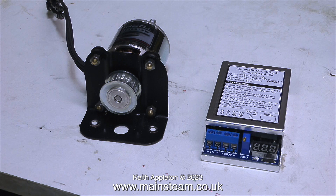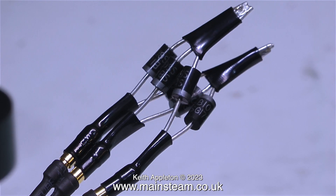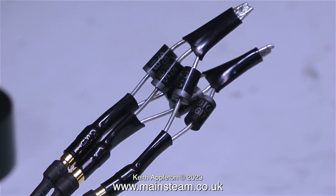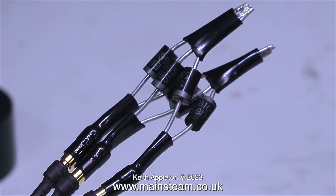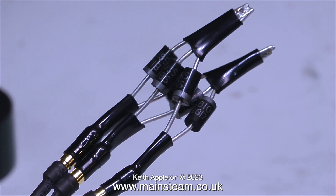The generator is on the left — although really it is a brushless motor, not a generator, but it's been converted to a generator by adding a set of diodes on the end of the output leads. This was very kindly sent to me by a viewer from the USA, a man called James Hawley from Minneapolis — thank you for that kind thought. This is the cluster of diodes on the output of the motor; you can see how the three output wires are wired to the diodes.